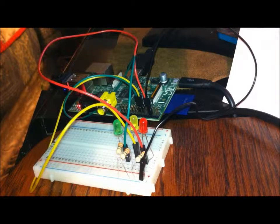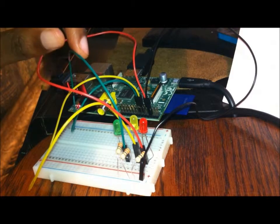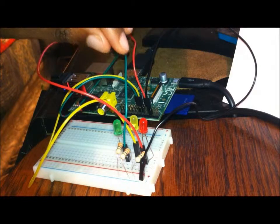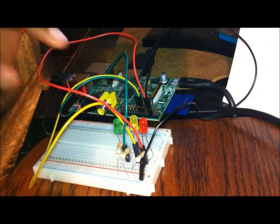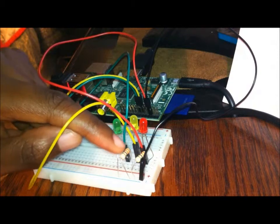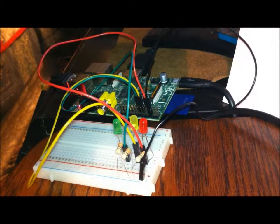The last portion of the setup is this green wire — the jumper lead from pin 13 goes to the seventh row of the breadboard. The green LED is connected to the seventh and eighth rows, with the positive long-leg side on the seventh row. The resistor for the green LED is on the eighth row of the breadboard and the minus side of the power rail. That's pretty much what the circuit looks like.